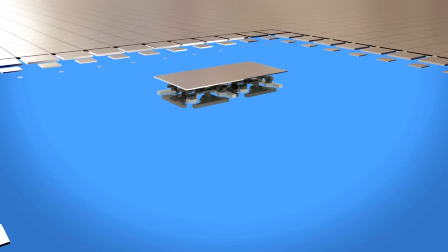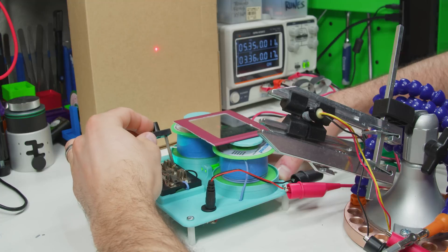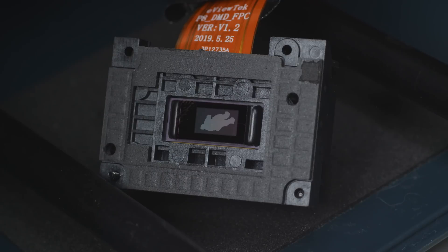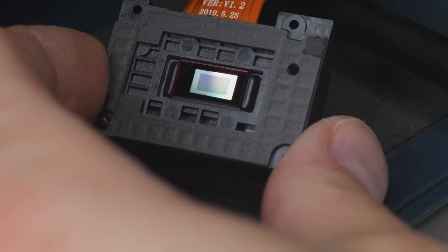A circuit beneath the corners gathers and concentrates electrons, and the difference in charge between the electrode and the mirror pulls them closer together, tilting light in that direction. Dump the charge and the yoke springs back into the neutral position. The DLP driver can do this on every pixel simultaneously, causing the whole display to instantly snap from frame to frame. This means digital micromirror devices don't have artifacts like tearing or smearing — and it makes this chip literally 3.7 megabits of buffered static RAM that you can read by shining a flashlight off of it.